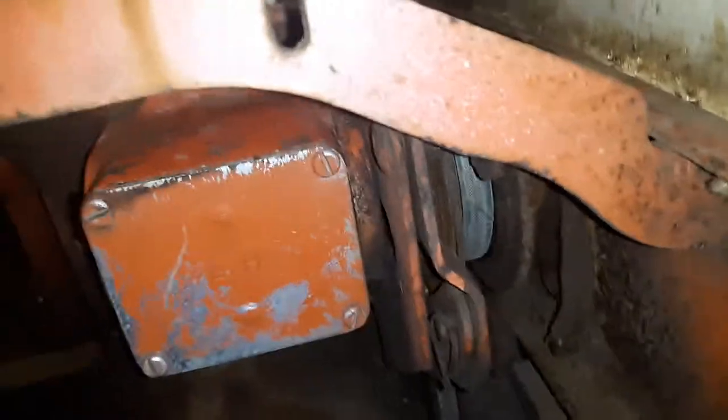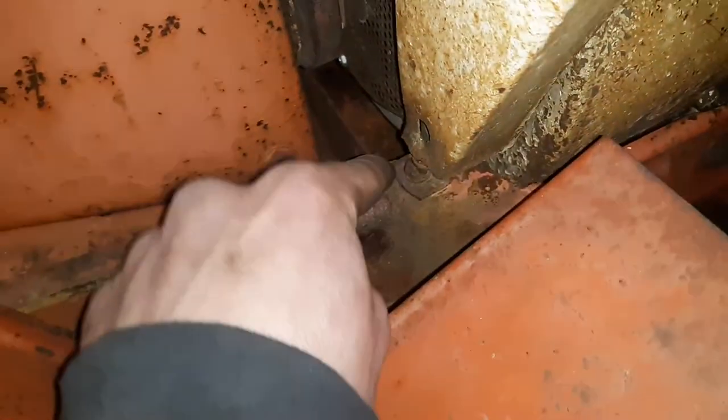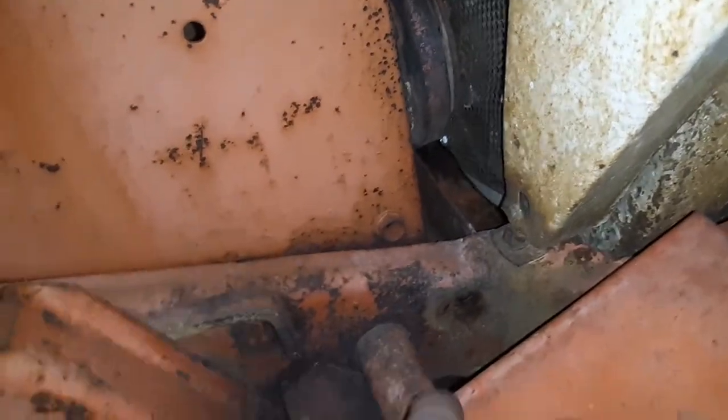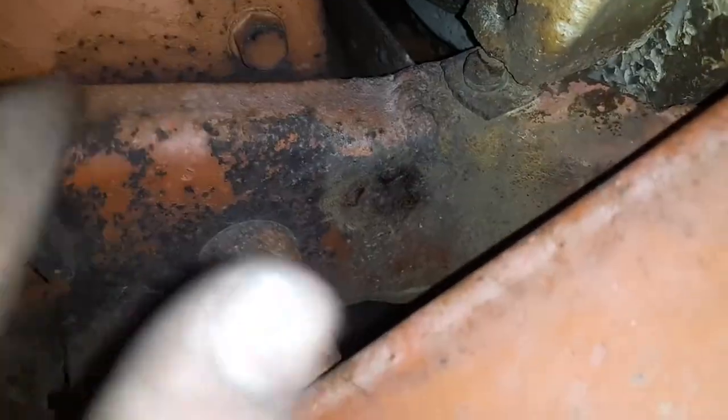On these stamp frame Gilsons the biggest thing — it was notorious — they always cracked and broke. If you look right there you can see another crack. So I'm gonna have to take this down when I restore it. I also didn't notice this about this tractor — it's got a pretty big gaping hole right there, so I might be plating the frame on this unit. Other than that it doesn't leak any oil; the gasket seems pretty good, but when I restore it I'll put a new pan gasket in it.